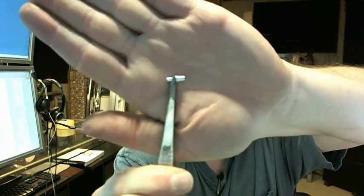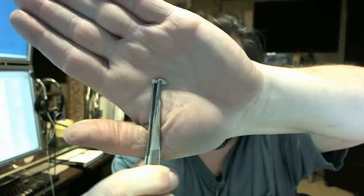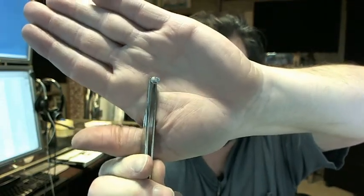Let's just go over it now. How you set the tension is you insert the included tension rod into the tension collar hole, which you can see there, and all you've got to do is just bring it back, and doing so allows you to reveal additional holes. So right now the tension is set on this — I'm going to put it on the desk because it's not to snap my fingers. So now I've got the tension rod and the tension pin removed, and I'll show that to you. That's a tension pin. Inserts into the hole — the small side is what goes into the hole and the big side here is what hits the shoulder of the hinge.